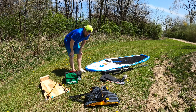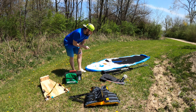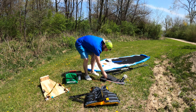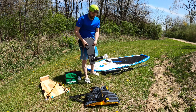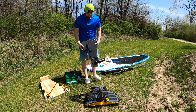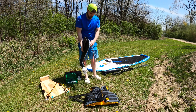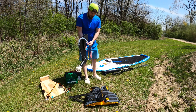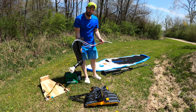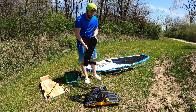Today we are going to try the electric outboard engine with my paddleboard. Just a quick rundown — this is my outboard setup. Essentially it is a 9,000-watt electric motor hooked onto this sort of makeshift outboard. Some cooling lines, power lines — this is all going to go to a 150-amp RC boat speed controller. We'll see how well that performs.